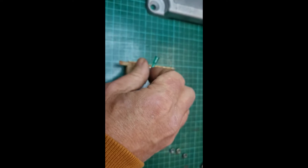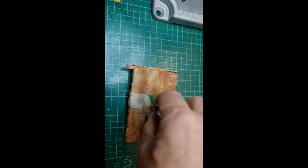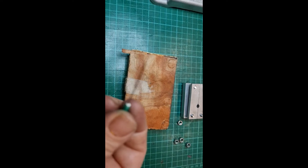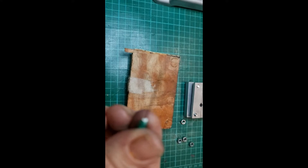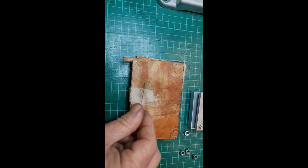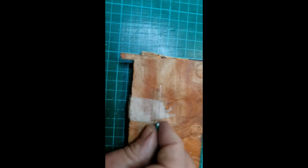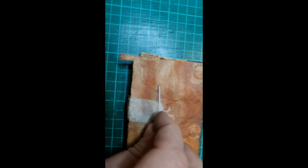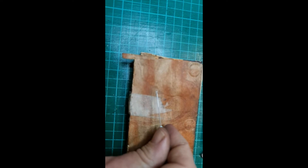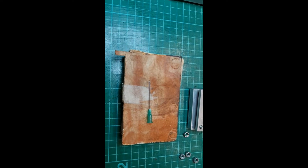I'm going to show you drilling the ring out and then silver soldering in all the syringes. The tip is just bent over at 90 degrees — ideally just less than 90 degrees. I'll try and get some better pictures to illustrate it once I build the fuel ring with the 18 syringes in. But that's how the whole process starts. Next, I'll be trying to drill the 18 holes — 0.8mm holes. I've shown you bending the tips of the 0.8mm syringes — I think they're 18 gauge.